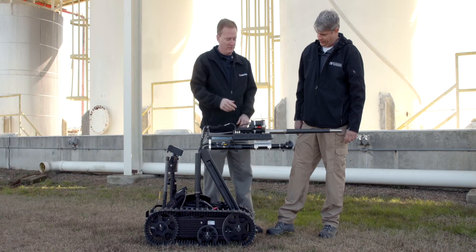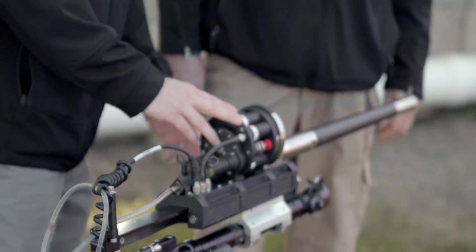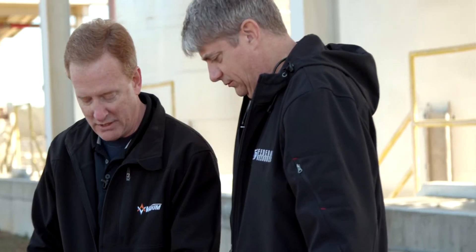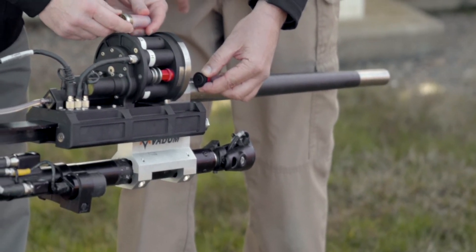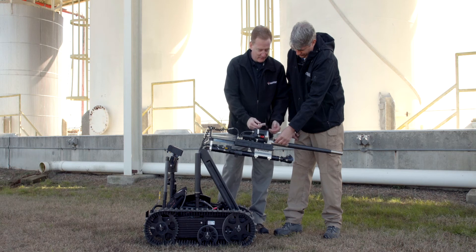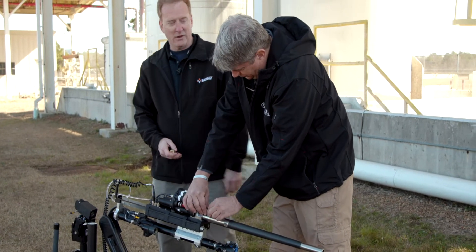Off of this platform here is a pump and a bag that has enough water in it to support up to seven water shots. There's a single chamber here, so what would happen is you would robotically move to the tube that has the seal plug, and the cartridge would push that seal plug into the forcing cone of the barrel. Then we rotate around to that water filling adapter, which is basically just a tube, and we load water in that way. When the water comes in, it would go through a little hole in the back end here, and these would separate and fill the barrel with 140 milliliters of water.